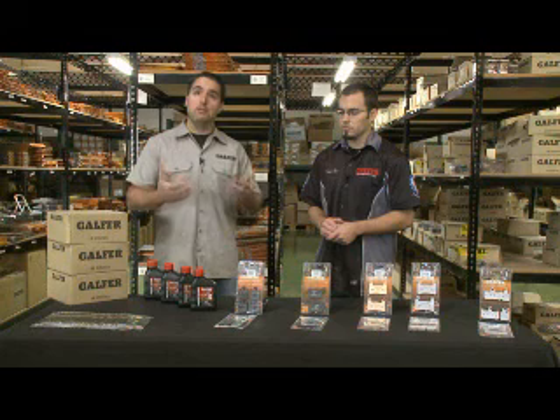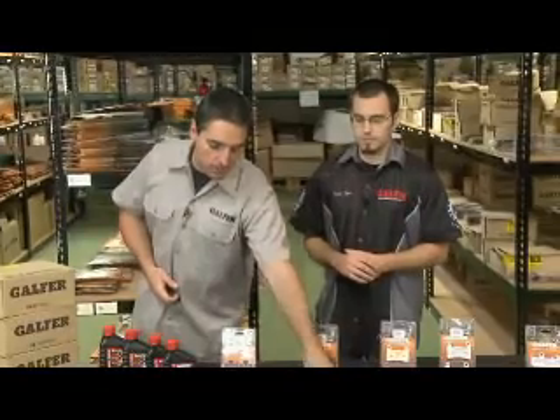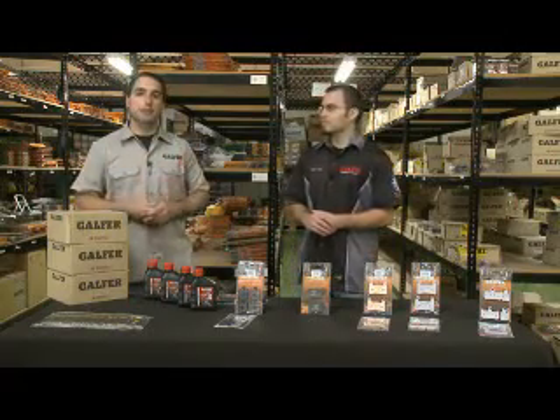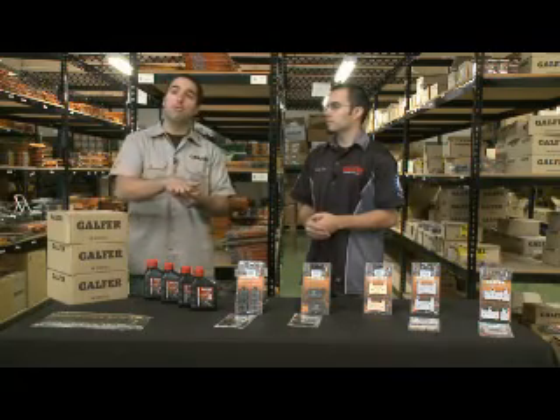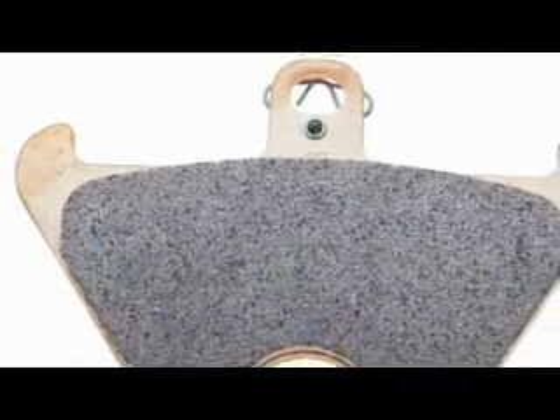You'll also see that the thickness on the backing plate is slightly thicker. When being manufactured, the backing plate is on one side and the compound is on the other side. Semi-metallic brake pads go through what we would call an oven process — the backing plate and the material come together, and the material is bonded onto the backing plate with resins. The resins are pressed against the backing plate and together they go into an oven process; they cook and that's the end of the story for semi-metallics. On full metallics, the brake pad is pretty much about the same story — the backing plate comes along, the material is bonded on top of it under pressure and under high heat. Every composite bonds to the backing plate differently.